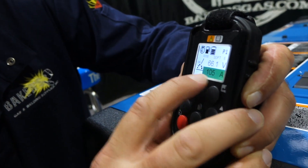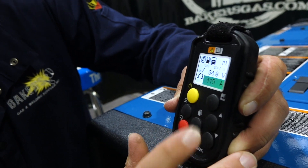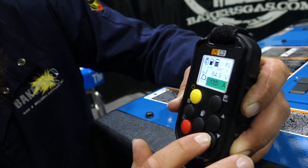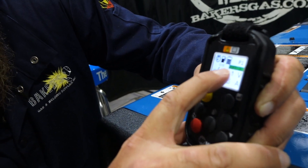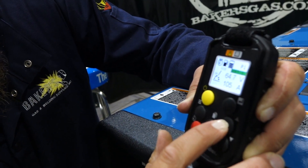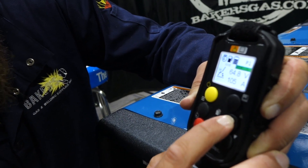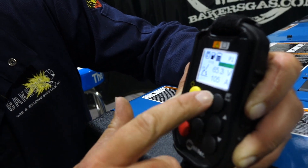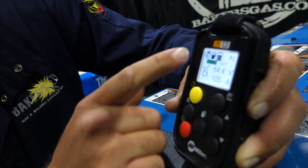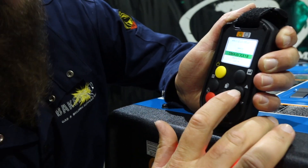So to change that — see how this is highlighted green — 105 amps, we can increase our amperage for our stick and we can decrease it. To go and change our dig setting, which says soft, we can go to neutral on our dig, we can make it stiff, or we can make it soft on our dig. Pretty unique — and then you hit enter again and it jumps over to that. So we get in there, hit the up arrow, and now we can change our process.